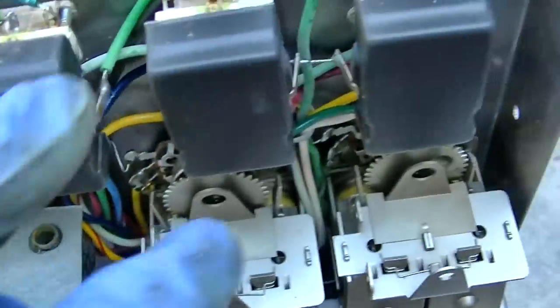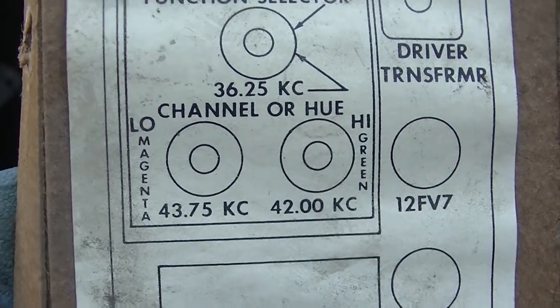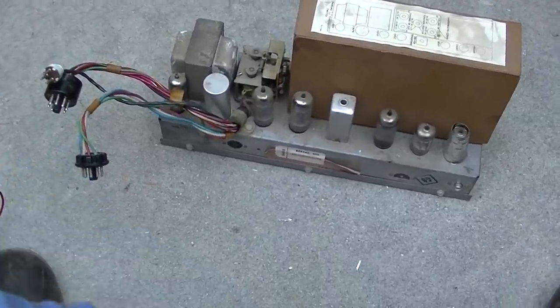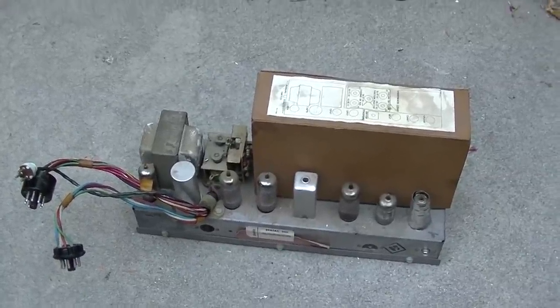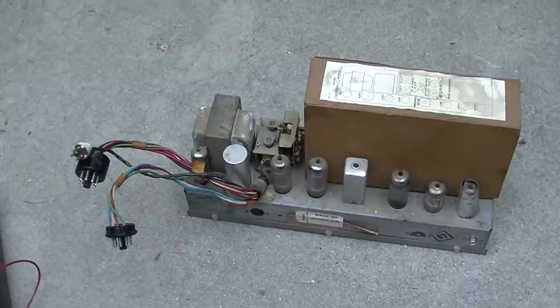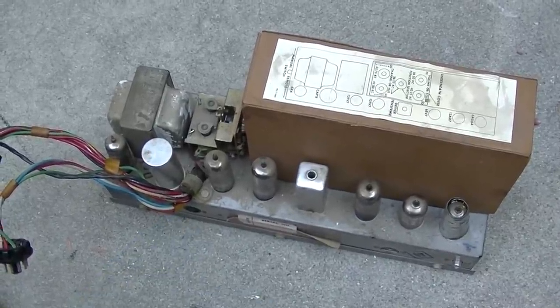These are relays — these are your resonant tuning slugs, here are your frequencies for the remote control. Although this is cool, and hopefully we might attempt to get it to work at some point depending on how much this TV grinds me into the ground, I think in this day and age since we don't have multiple channels, the headache it would cause is more than it's worth. This is a poor design — the remote can override the manual controls on the front of the set and if this fails you're stuck.